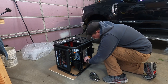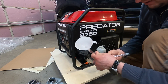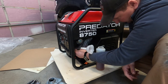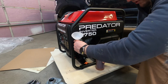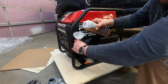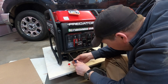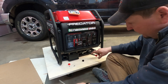They ship a funnel because the oil fill is behind the panel — it's a funnel with a hose on it that has a little kink, so it might be troublesome. You may want to provide your own vinyl hose. The manual calls for 1.1 quarts of 10W30 over 32 degrees, so I'm using Traveler 10W30 full synthetic — about 26 ounces this first round, overall about 35 ounces. It comes with a lithium battery; I'm not sure how it'll perform in the cold, so I might end up upgrading to a lead acid.